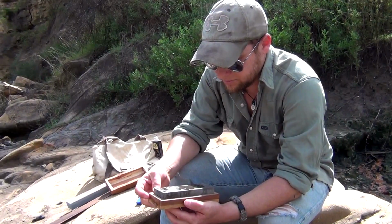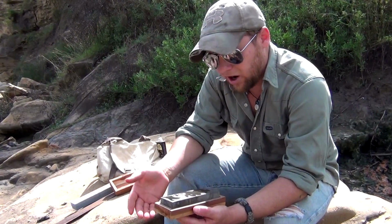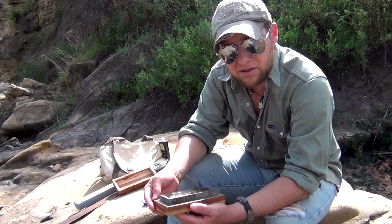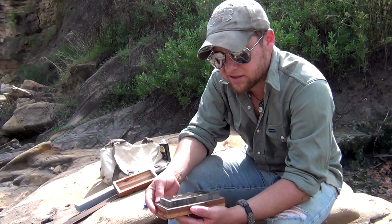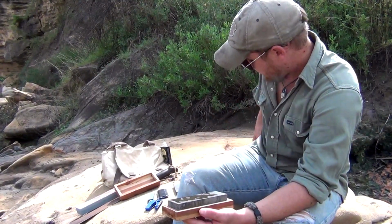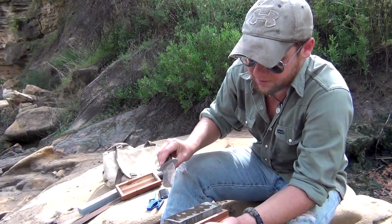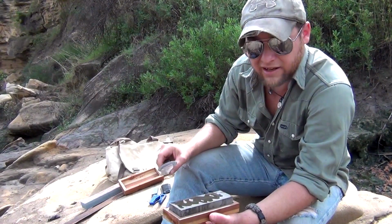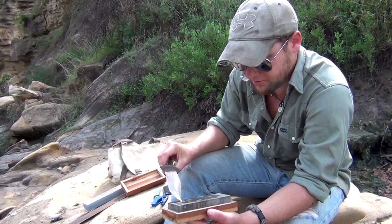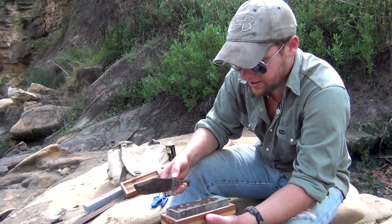So you'll see people with bushcraft skills and bushcraft blades being at about 30 degrees, all the way down to your super expensive chef knives at 10 degrees or less, the surgical scalpel ideas. Now most of those angles are not going to mean anything. And you just saw me put the oil on here. Again, that helps keep a lot of the particulate matter that we're going to build off of the cutting edge and off of the sharpening edge.